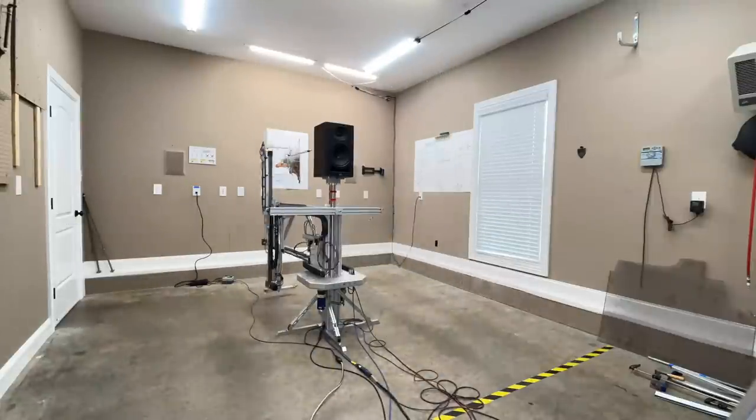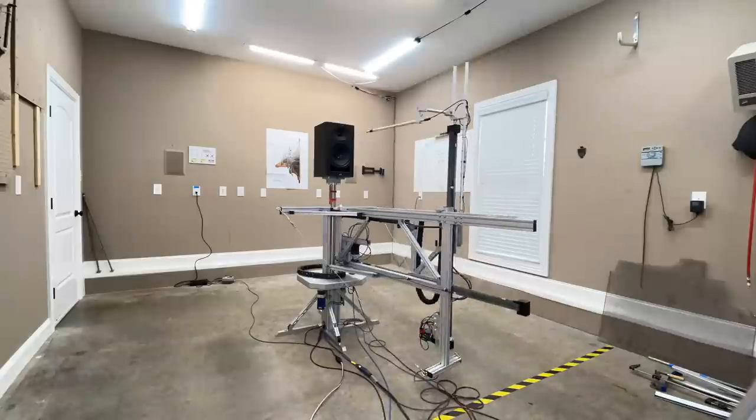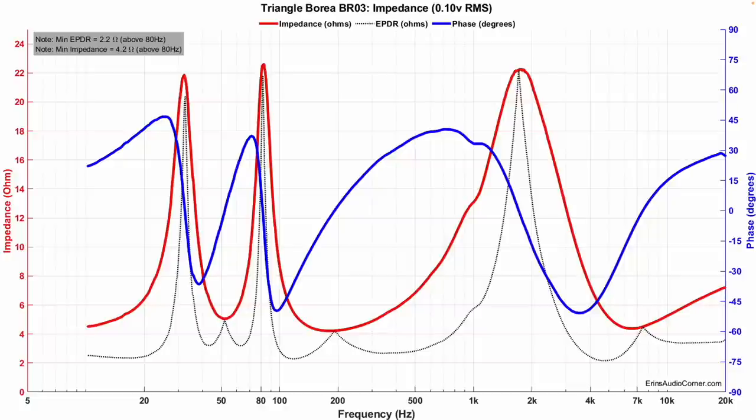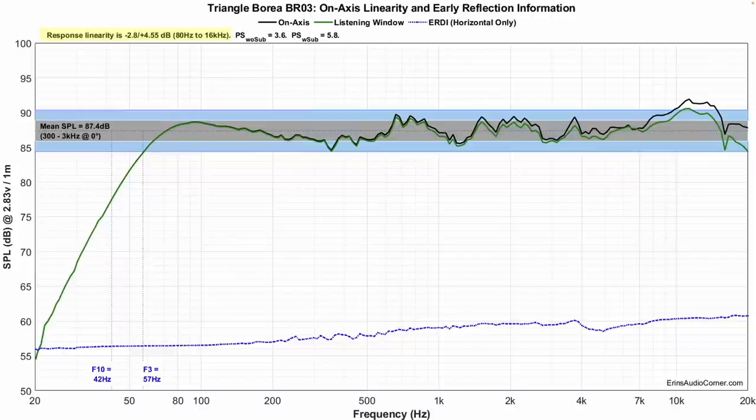All of the data you're about to see were captured using my Klippel Near-field Scanner — a state-of-the-art robotic device that allows me to get anechoic data from a speaker in a non-anechoic environment, so we can see what's going on with the speaker itself. The impedance is about 4 ohms, though the website and back of the speaker rate it at 8 ohms. If you own these speakers, I'd be curious whether you're running them with an AVR — I'm thrown off by lower impedance around the 200 Hz area, dipping almost to 4 ohms. The EPDR is even lower. I'd lean toward a separate amplifier, especially for a full home theater setup. The on-axis sensitivity is about 87.5 dB at 2.83 volts, one meter.